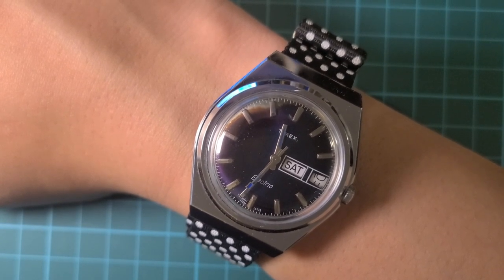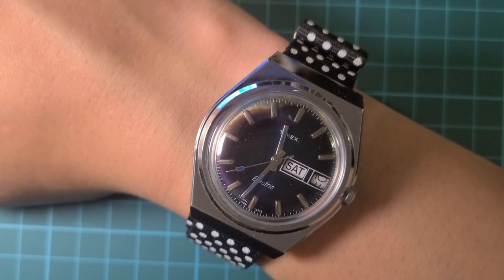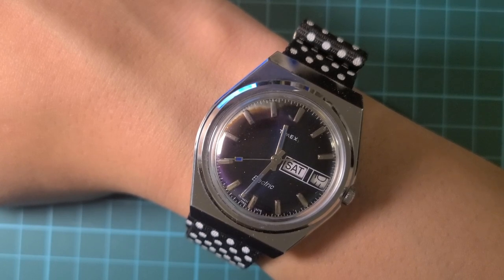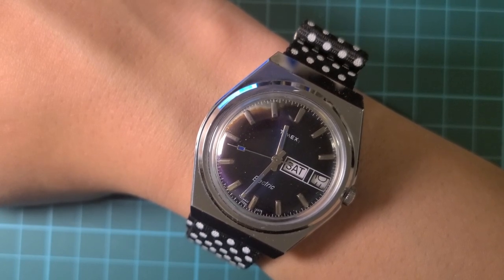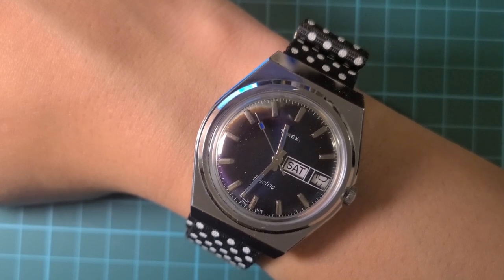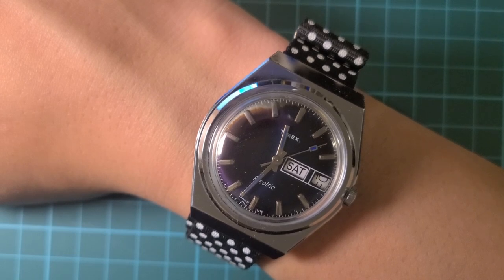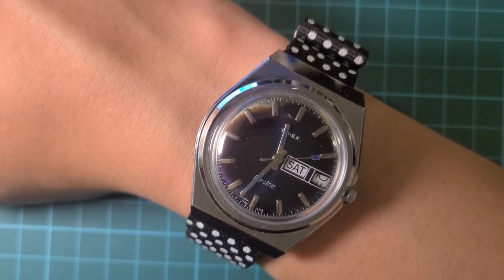Normally, you'd think that shouldn't work. The bridges and pivot holes should be different so that this kind of thing doesn't happen. However, on a Timex Electric and Timex Dynabeat, their bridges and pivot hole locations across the entire line of movements are exactly the same between the Electric, the Dynabeat, the Q Quartz, and the Electronic. So if you plop in a balance or pallet fork from one of the movements to another, they'll fit. And sometimes they'll run properly, but other times they won't.